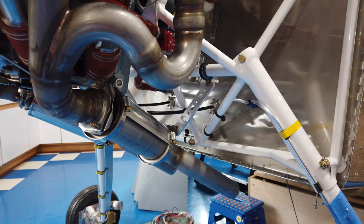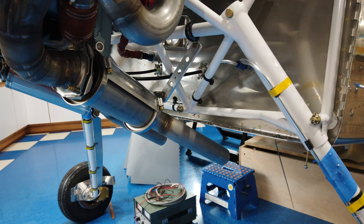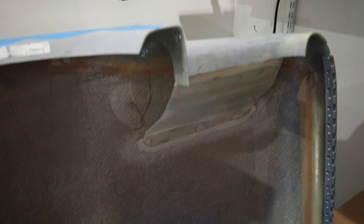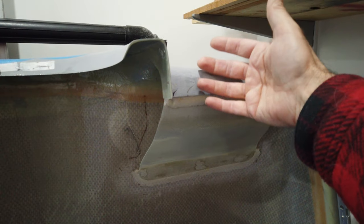So I've decided to move on to something I had kind of forgotten about until a couple of weeks ago. On the upper cowling I had fitted these fiberglass inlet ramps — pieces of fiberglass just to help the airflow come through and effectively do its cooling job. Without these, the air would break and be very turbulent. The job of these inlets is just to keep that airstream smooth and let as much air as the intake will allow to come in.